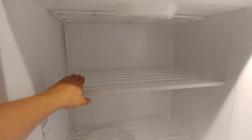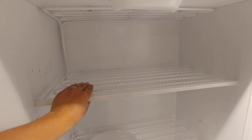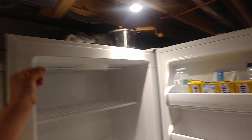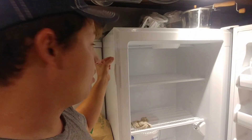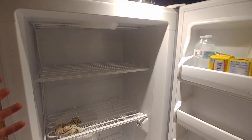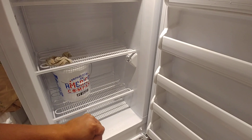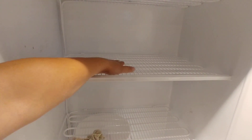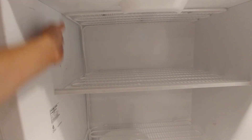Consequently, these shelves will accumulate ice because when you have something that's really cold and it's below the dew point of the air in the freezer, they're going to accumulate ice on them. About once a year — or in our case less than that because the door got left open just a crack — when you've got that open a little bit, you're harvesting all the moisture in the air and it's accumulating inside your freezer, so we're having to defrost it. A traditional deep freeze chest freezer is the same way — it's not frost-free because the ice accumulates on the sidewalls, since instead of tubes on a shelf it doesn't have shelves, those tubes are right on the other side of the surface of the freezer. And some upright freezers also have tubing concealed behind the sides.